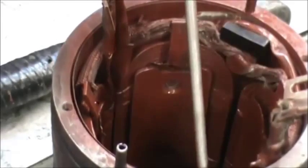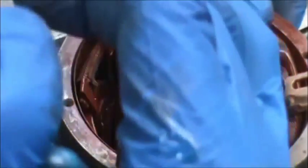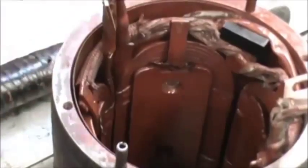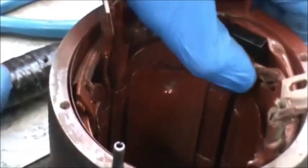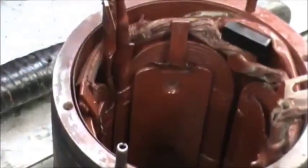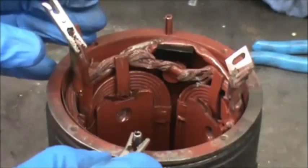You can see how the wire going across there is tucked behind it. We have to make sure that these copper leads to each individual field are pushed back away so that the armature doesn't rub it. Take a pair of needle nose and just squeeze them lightly back so that there's room on the inside diameter. Also, there will be some stress on these wires from replacing the insulator — make sure that they're pressed back as far as possible out of the way.